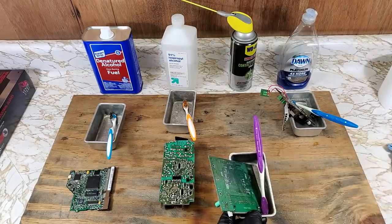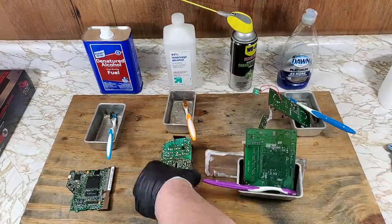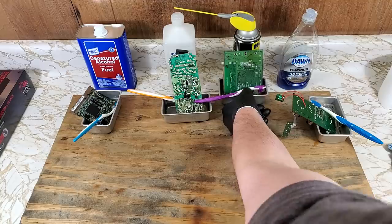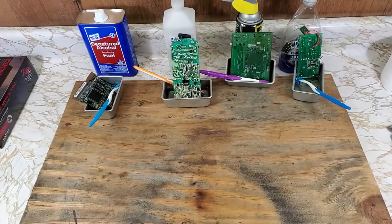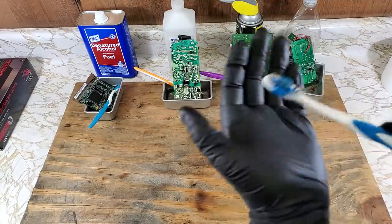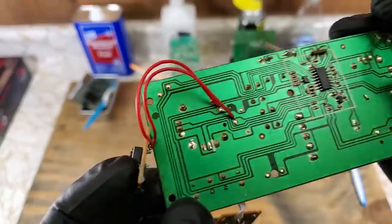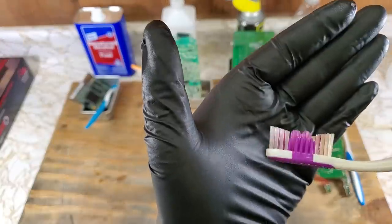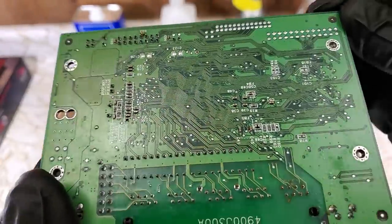And allow the rest of the board to dry completely to see if there's any residues left over. I'll be honest, I'm mostly curious about the contact cleaner because it has that chemical smell, and the denatured alcohol because it can remove paint and the like. It has now been a few hours. I checked on them every hour or so just to make sure that there wasn't any major reactions happening. The toothbrush is fine — dirty, but okay. The board looks good. This toothbrush looks great. The part that was soaking has some flux residue on it — that wipes right off. Otherwise, looks great.